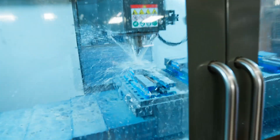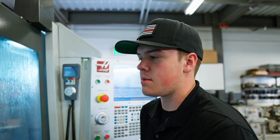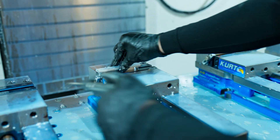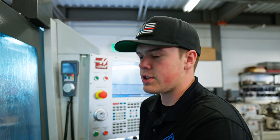And you load them all in here. How many are you doing at a time? Three per time. So you'll have the first process — it takes off most of the metal. And then you'll have the second process where we flip it over and it cuts the bottom half where the jaws were holding onto. And then you move it to the third level where it just finishes up the last bits.